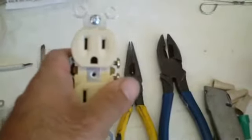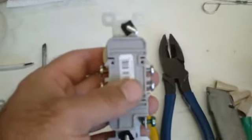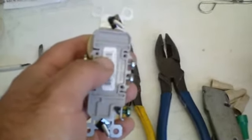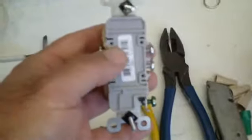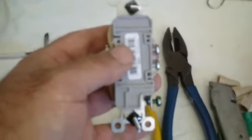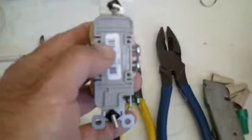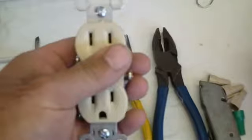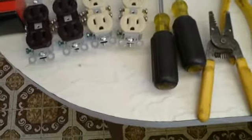It is loose connections that cause fires mostly, because loose connections aren't able to handle the current, and they heat up and heat up and heat up. They heat up and they catch fire, whereas a breaker, an arc fault detector may help against it, but a breaker detects an overload or dead short. If you've got a loose connection, most likely you're going to have issues where they heat up, because I've taken these out.